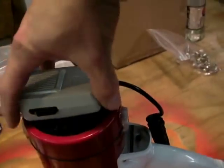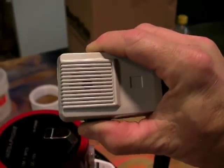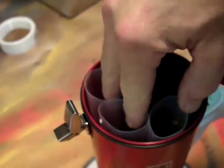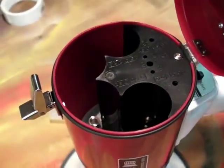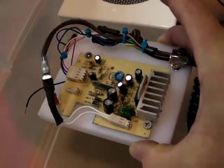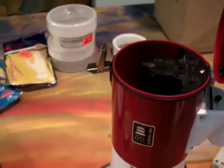There are the scraps. It has a mic on it — they call it a differential mic, and it really does work well; you hold it right up to your mouth to talk into it so you don't get the wind problem. You open the whole thing up and it takes batteries, so it's 12 volt. You take this out and it's got a card mounted right underneath — just this one here, mounted on a piece of cutting board. That card has the siren and the amplifier for the microphone so it can drive the speaker. That's really all we're after: the microphone and that 50-watt amp card.